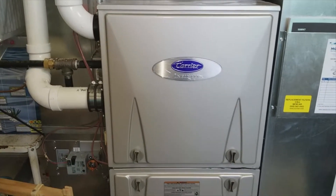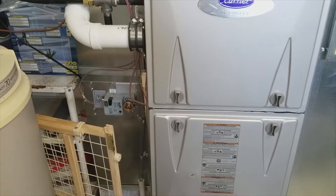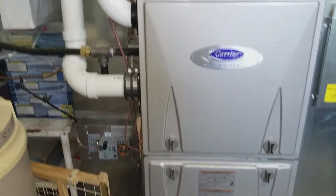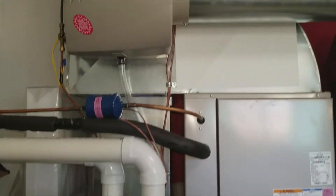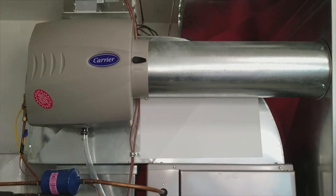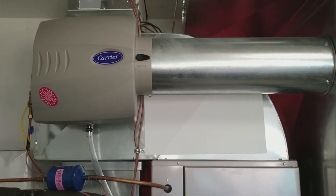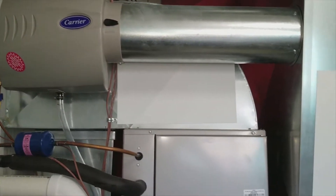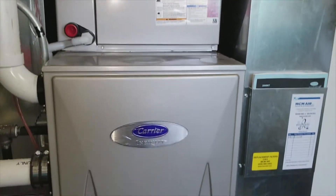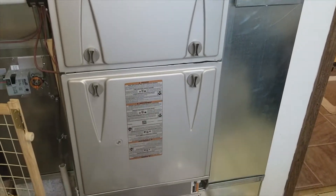Even though the fan only goes at a certain speed, the valve slowly opens and closes to control airflow based on the amount you want to each part of the house. The humidity control is set to not over-humidify the windows, and it's based on the temperature sensor on the north side of the property. The system has been running fantastic all winter with no problems. The one thing I noticed is that running it constantly means I need to replace the filters more frequently.